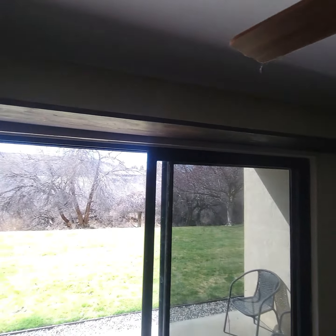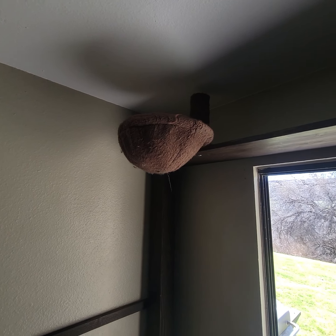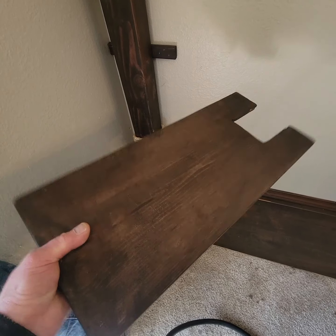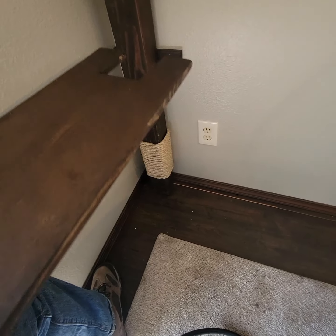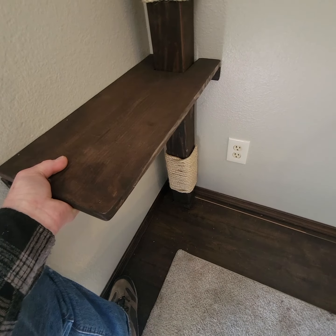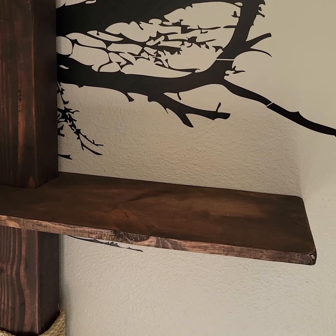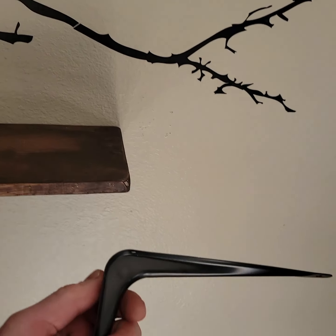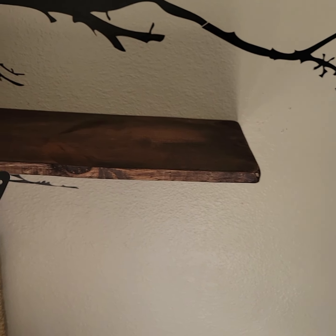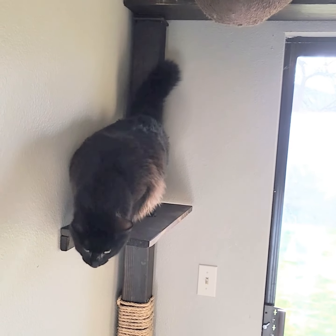With the structure complete, we thought it might be a fun idea to repurpose some of the good pieces off the old cat condo onto this new one, to help make it a little more comfortable for our cats to transition. Next we install the shelf — I've put a little bracket on the back so we can adhere it to the wall. It slides in place and we put a level on that and fasten it right up. The final step is to strengthen the platforms with some shelving brackets — I like these little metal ones from my local Ace Hardware, only a couple of bucks. They screw right in place and work just dandy. When the cats jump down it's very stable and very solid.